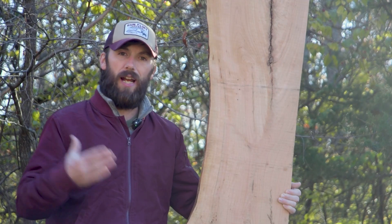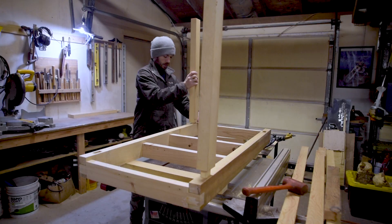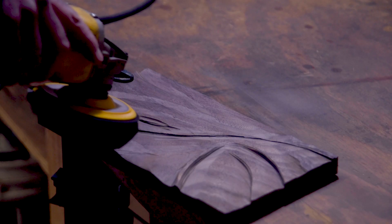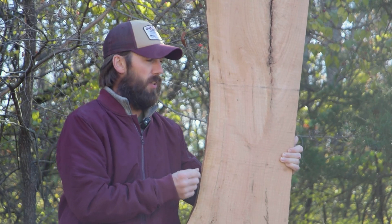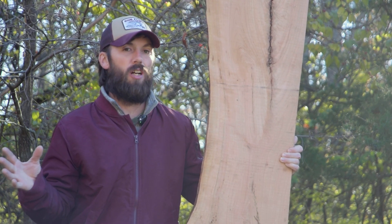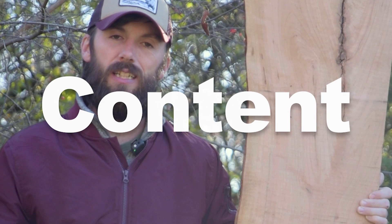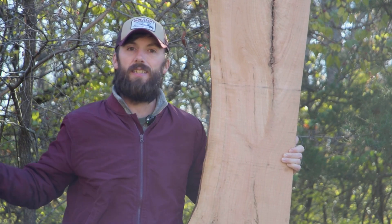The real goal of drying wood is to get it to a point where you can do something productive with it like carpentry, construction, or some other crafty DIY thing. To do that, it's got to get down to a point where it's no longer gaining or losing moisture within its environment, and that's called equilibrium moisture content, or EMC. All that means is that it's at equilibrium with its environment.